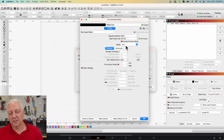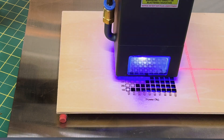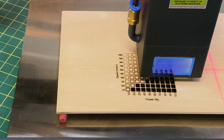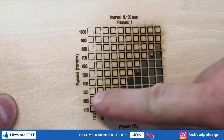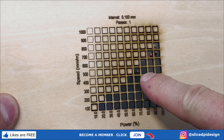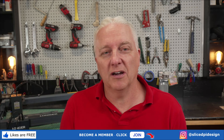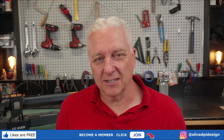Looking at the material settings, the mode is set to Line, so this will be a cut test — something I always do with any material. In Chris's case the material is bamboo, maybe a cutting board, so you might want to skip this, but it's something I generally do. After running the test, you'll see there are places where holes are cut and places where they aren't. This tells you which power and speed combinations result in a successful cut. For example, 90 percent power at 500 millimeters per minute is guaranteed to give you a good cut on this material.